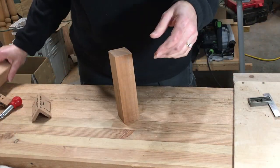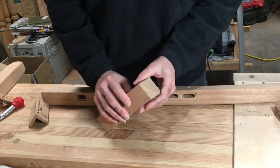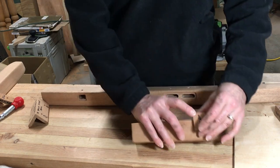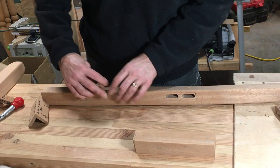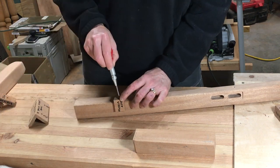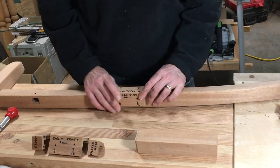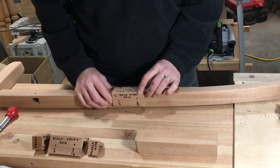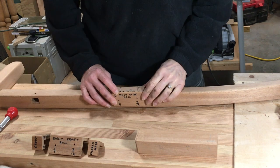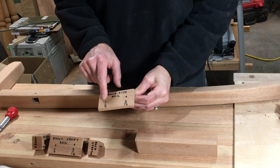So that's my front leg. For the back leg, I'm going to dress the sides first. I was able to use the sharper pointed edge of my leg template to set these lower stretcher and side angles. That fits on here correctly, so by lining this up again — same as in the front — I line my jig up with the mortise and that determines where my hole will be plunged. For the back side, this is going to fit on perfectly for this angle. I line it up with the mortise and this identifies short tenon on the top, long tenon on the bottom for the side. For the left side, I simply rotate it the other direction and that will identify those positions the same way.